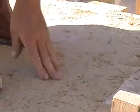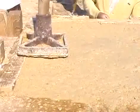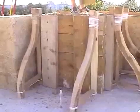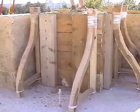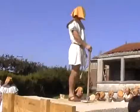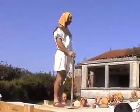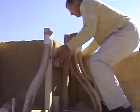When the climate is warm and beautiful, our crew rapidly produces a re-agglomerated limestone that proved strong, dense and true to the plan's size and shape. The mold consists of small wooden boards, which can be reused many times for making other blocks. In this ideal weather, the whole process runs smoothly and is very simple. We remove the mold 4 hours later.